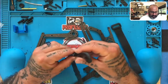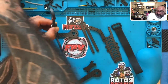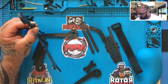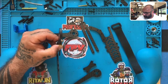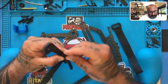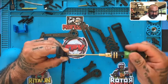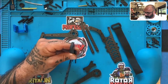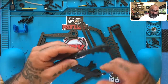The first thing we're going to do is start by putting our arm, lining it up, and putting the front bumper underneath just like that, and we're going to get the screws to go through the front here. I did adjust the screw length, so I'm just going to grab these as I go and make sure I have the right ones. We've got 5 and 11, so I think a 12 mil screw — we've got six millimeters between the two bumpers — going to the standoff. I'm going to put one 14 mil screw right here because even if it protrudes just a little bit, that's not going to be an issue.